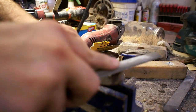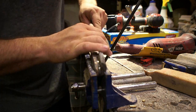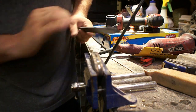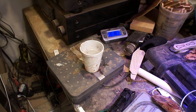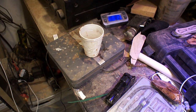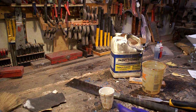After that was where I wanted it, I came back in and started doing the profile with the file, then moved up through the grits on sandpaper to get it nice and smooth. This knife probably isn't going to be used that much — if it was, I would have used more of a flat finish on there.